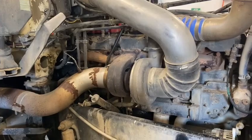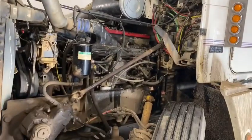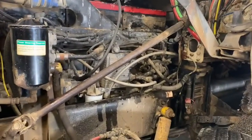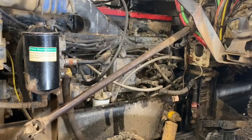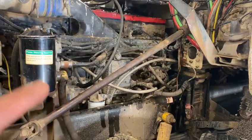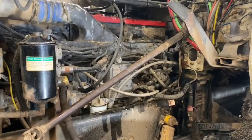So now I got my fuel gauge rigged up there again in the window. We're making 25 psi within three to five seconds, like Insight tells you, and we're running at about 150 to 160 psi. So no issues with fuel pressure. I also got a test ECU because I believe that possibly the injector driver in the ECU has failed at this point. So I'm going to put the test ECU on there and see what we get.